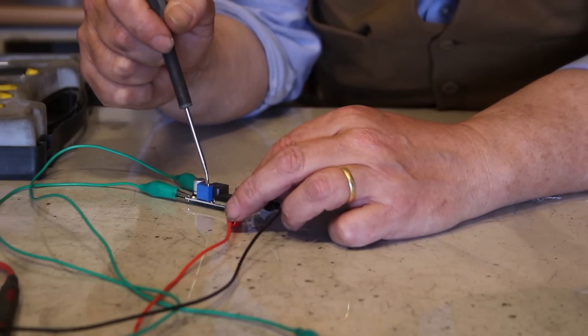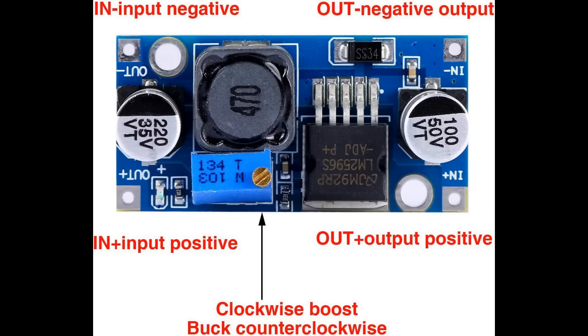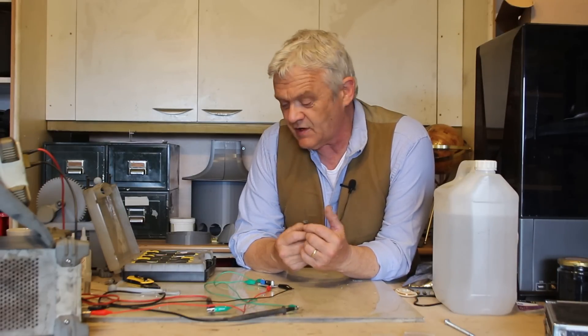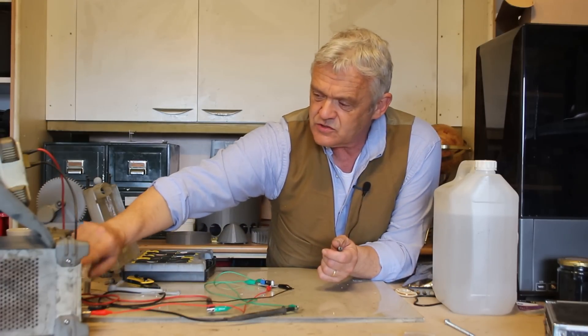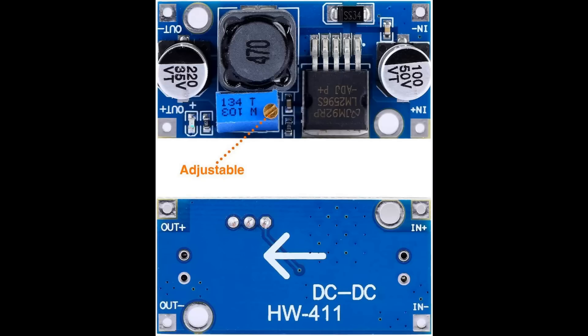There's a little brass screw right there — pop a small screwdriver in and give it a turn while watching the voltage. Clockwise increases the voltage setting; anti-clockwise decreases it. That is the stabilized voltage output. The output will be stabilized at whatever setting you just put, and it doesn't matter if the input voltage changes. So if you put in 15 volts, you still get 5 volts out. That's how easy something like this is to use. You just solder it in — plus to plus, minus to minus.